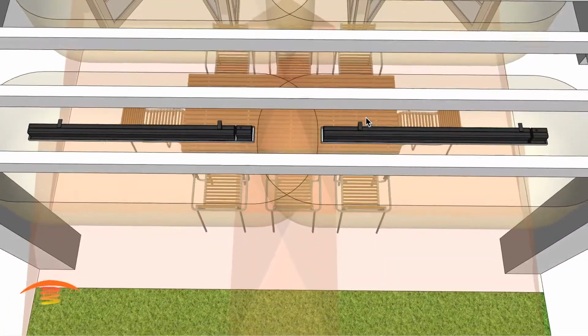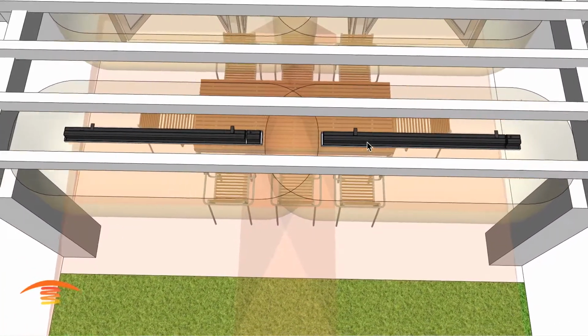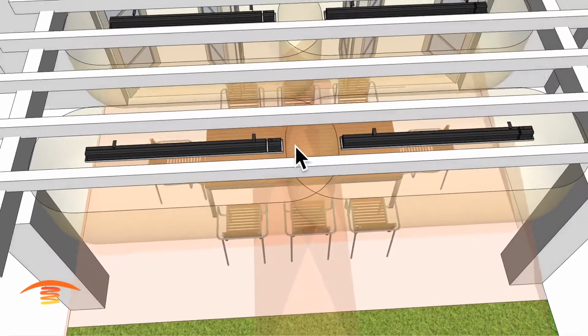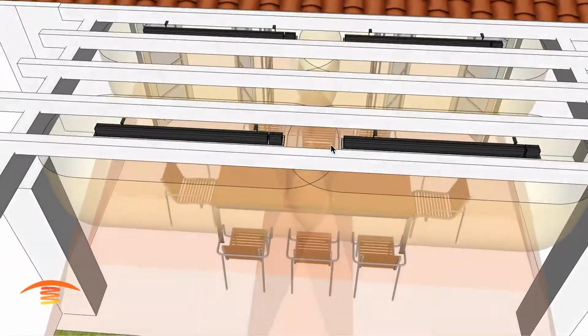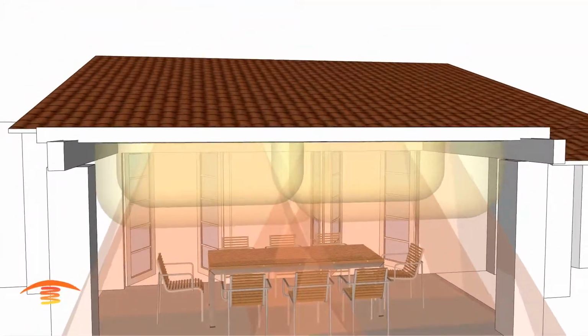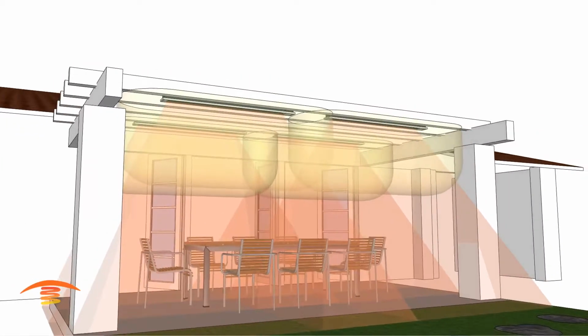But I just want to show this so that some people won't wonder why I didn't try this model out here. In any case, you need about 3 feet of distance between heater and heater. So that's the problem with this particular application on 4,000 watt units. So let's just go ahead and turn that off.